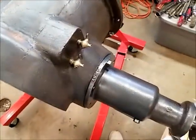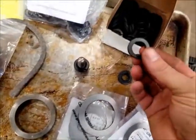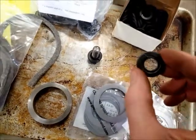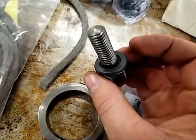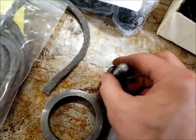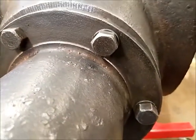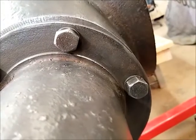We got some goodies from McMaster-Carr this week. My new lock washers came and the o-rings came. If you remember, this is what I planned on doing — putting the o-ring inside of the lock washer to keep it centered on the bolt to replicate those old lock washers. I actually put two o-rings on there because they're thin enough to fit. So there's the one without anything, this is a new lock washer with the o-rings on it, and it keeps it nice and centered. Comparing to the old style lock washer from the end, it's a perfect match — I'm really happy about that.